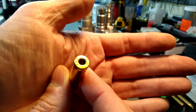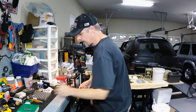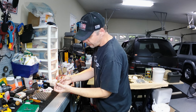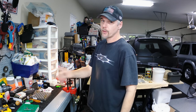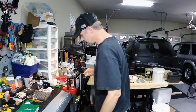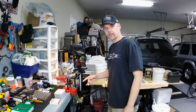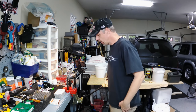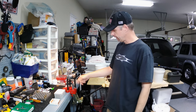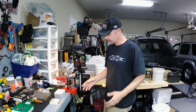That method is definitely cleaner - no brass shaving at all, just mashing the crimp out. On camera you can't see much difference but it definitely widened it out. So we got the reamed version on the Frontier, we used the swager on the PSD, and the Lake City brass we're going to use the third method on - I'm not sticking those in the swager at all. Let me get this press set back up for priming. Pull the washers right back off - you don't have to put the index key or rod back on right now since we're doing one step at a time.